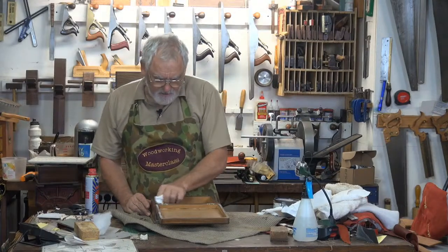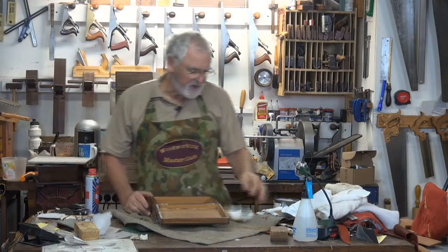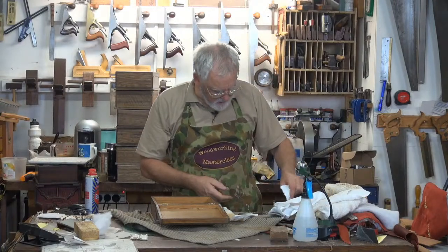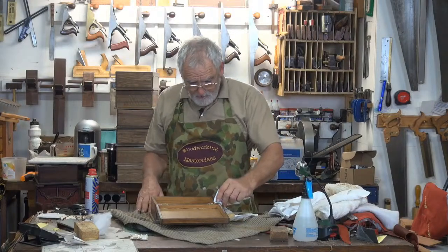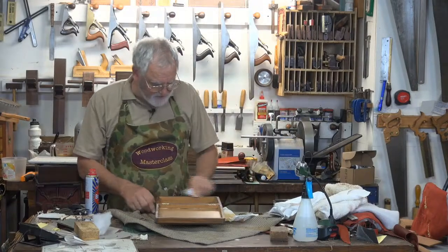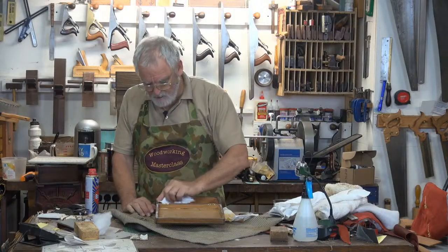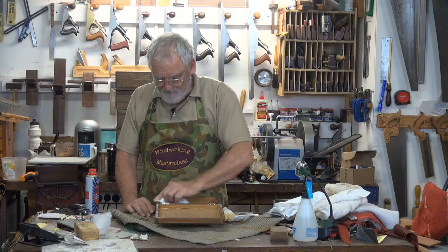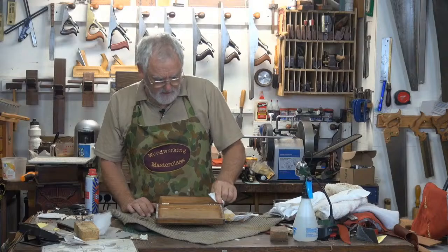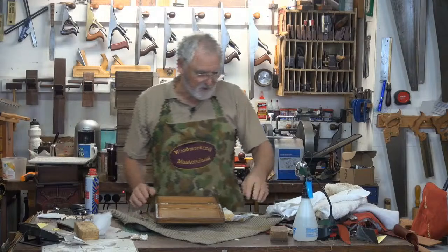And the other thing, not that it really would make any difference, it wouldn't skate, but just make sure you've got just the little bit of blade poking out under the, not the cap iron, what's it called? Yeah, cap iron. I have about 3/16 of an inch poking out under mine. Now, if you have a lot more, it can tend to get you gouging the timber rather than planing it, but that way you would still be planing timber, I guess, wouldn't you?